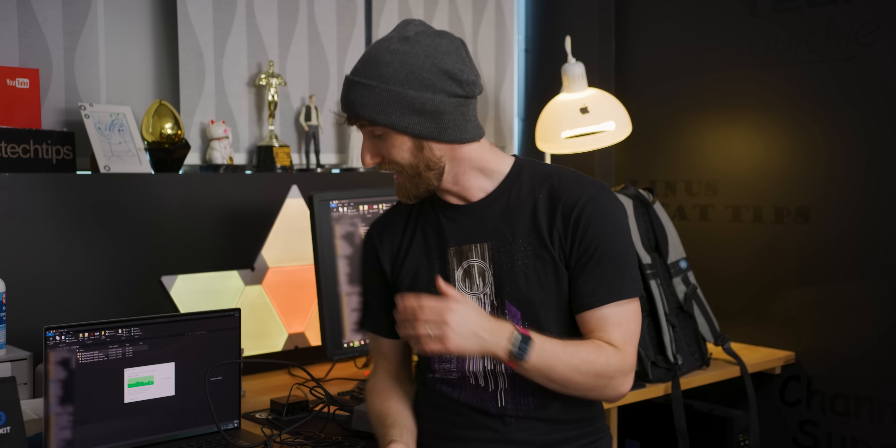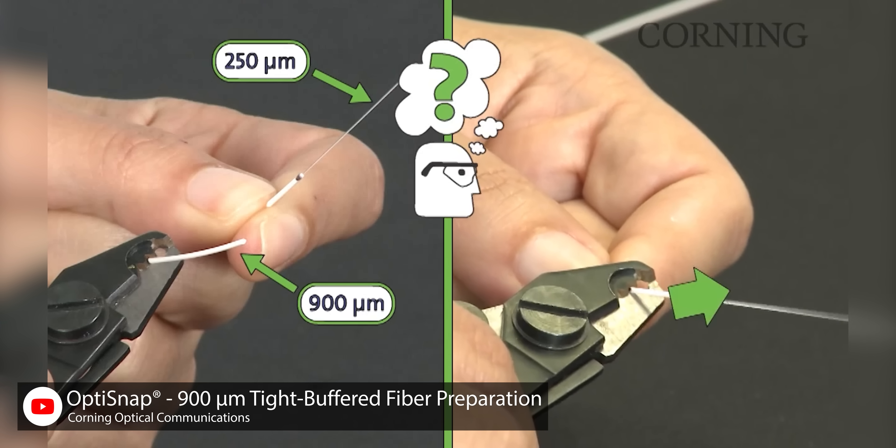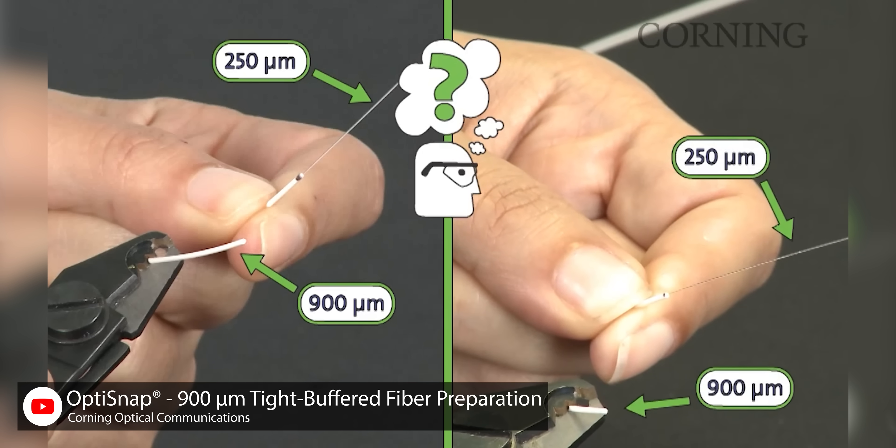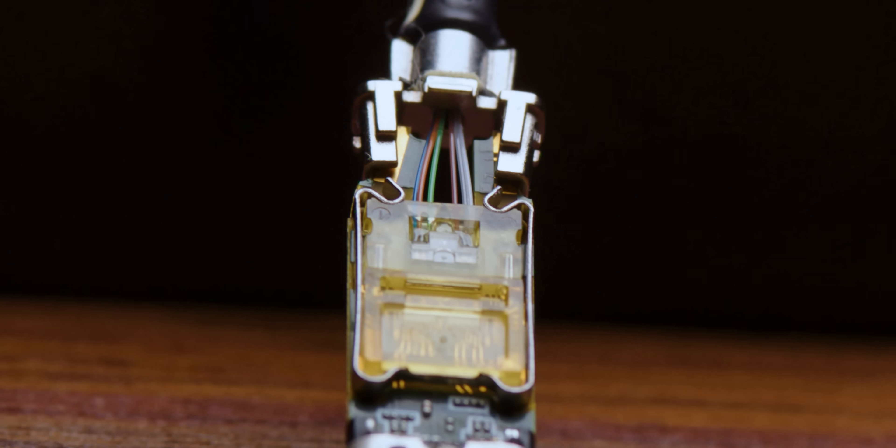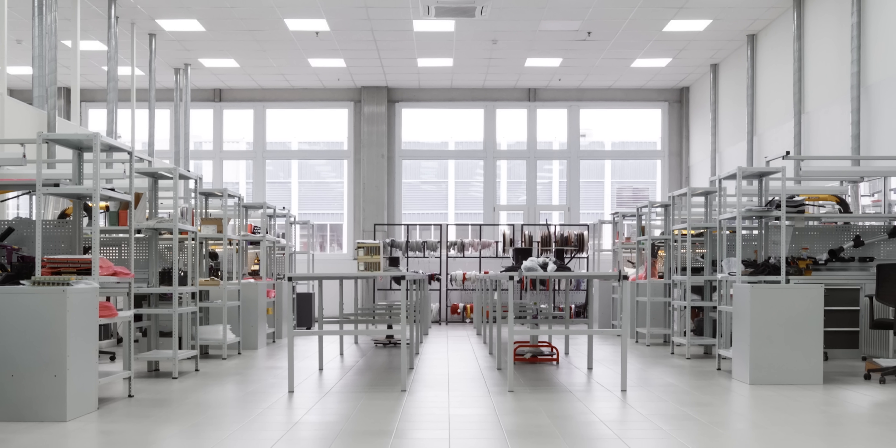The really truly mind-blowing thing is that for the laser light to be transmitted, the fiber in each of these cables has to be prepared exactly. The polymer coating on each fiber has to be removed, precisely cleaved, then the fiber has to be perfectly aligned and secured to its assigned laser or photodiode within 10 micrometers of tolerance. Much of this fiber handling work is performed in a clean room by hand and is super labor intensive — that is why they cost so much. Copper Thunderbolt 3 cables can only reach a maximum of 3 meters before the signal degrades too much, so while those are cheaper, for certain applications this is just the only way to do it.